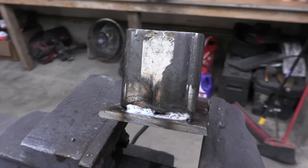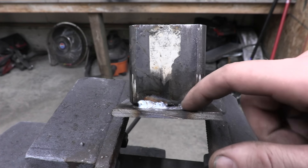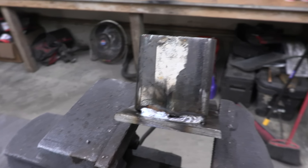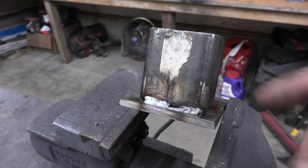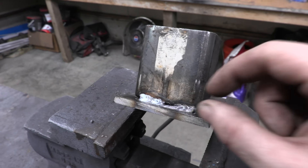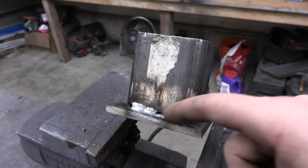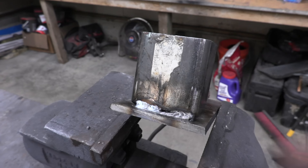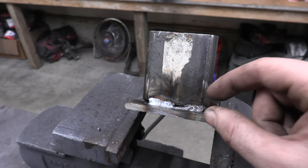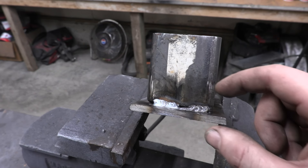Just getting started here and I already made a mistake — I had my welding hood adjusted too dark, so I missed a little bit on the center of the weld. Anyway, it's adjusted now so I'll be able to see on the next one. But you can still see what I'm talking about here — there's a big gap in there, and because I missed that center section you have to weld slower, allowing more time for the heat to penetrate into the material.